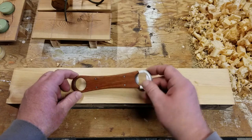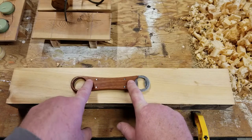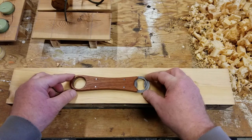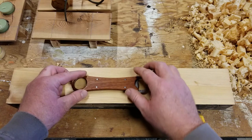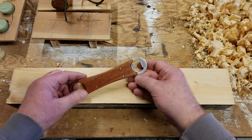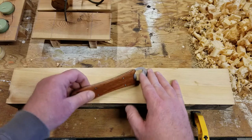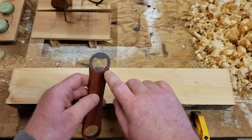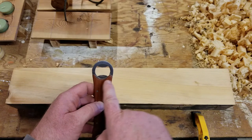And what happened was, I put the glue on, I clamped the piece on, and as many might expect if you're already experienced, but for a rookie like me, I was not expecting it, it started to slide a little bit, a lot more than I wanted as I would apply pressure. And I think just because of the wood on the steel, it was much slicker than wood to wood. So what ended up happening is, you can't see it on that side, on this side, it's almost hard to tell, but you could probably see how there's more of a gap here than there is here.